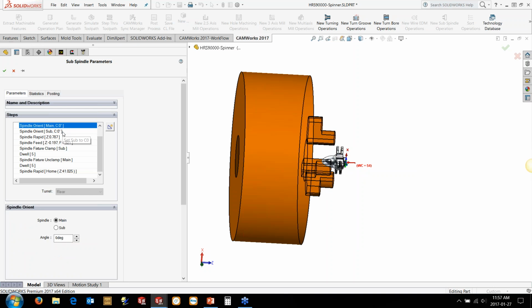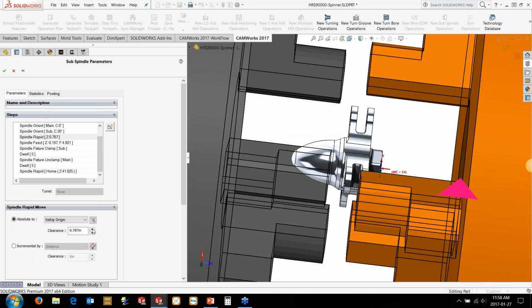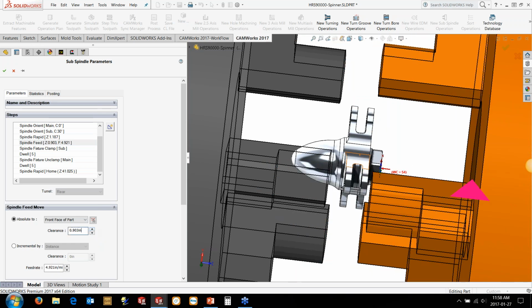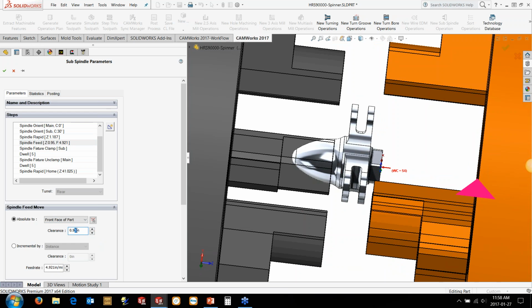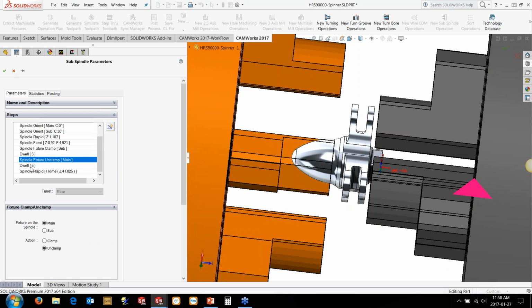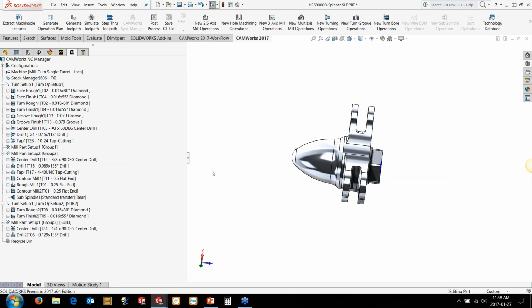In this case, if you click through the steps here, we want the subspindle to orientate correctly to the jaws and onto the hex here. So we need to put in a 30-degree angle for the sub. So it now is coming over. The Z is the rapid Z, so we're just going to basically tell it to rapid it over to somewhere approximately around here. And then we want it to basically be somewhere around, say there, so maybe 0.95 or something like that. Maybe a little bit 0.92. Then we need to clamp down, and you'll see the actual images as you step through. The pressure builds up with a dwell cycle. The main unclamps, lets the pressure off, and then takes it to subspindle home. So that's kind of how we deal with some of the transfer side of things.